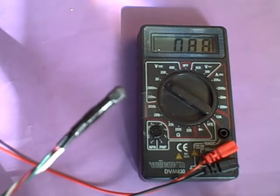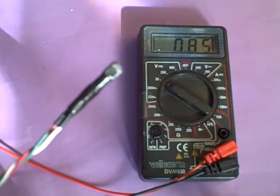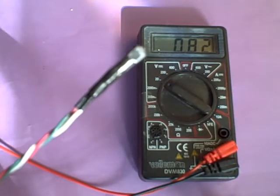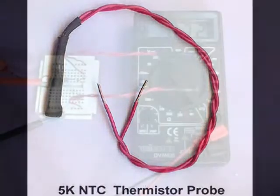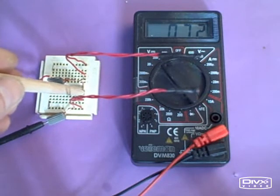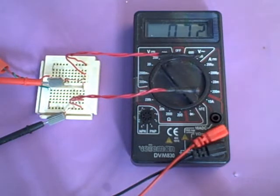This is a nice tool if we want to see the actual temperature. But as far as the differential controller goes, we don't actually have to know the temperature — all we have to do is sense a difference in temperature. We've connected our DVM probe to the common junction of the thermistors, so this should measure approximately half the supply voltage. The supply voltage is 14.2 volts.